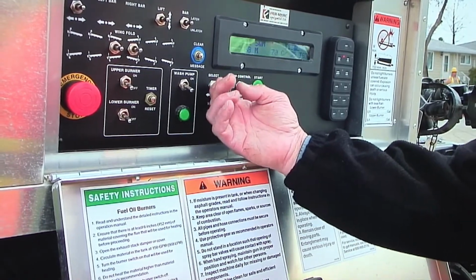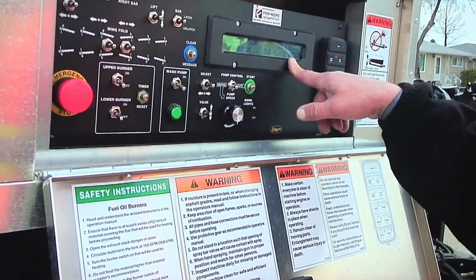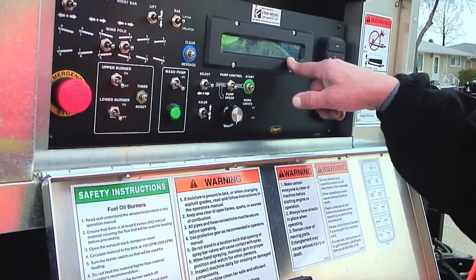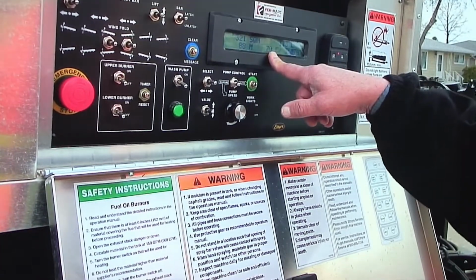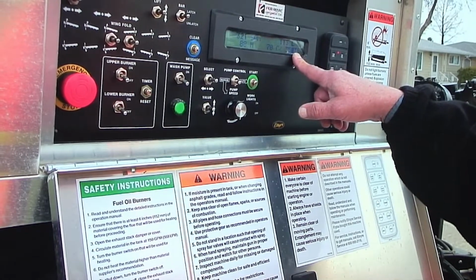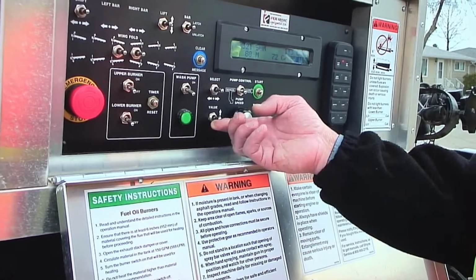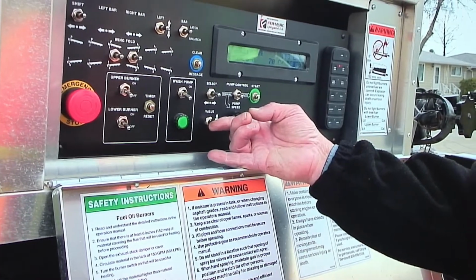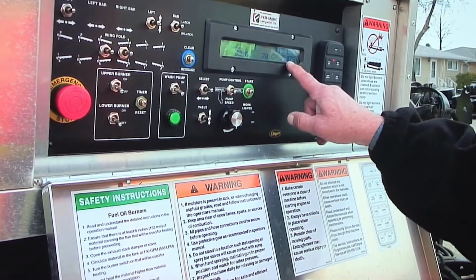3 points to the target temperature, which is defaulted at 35 degrees. At that point, we check our temperature of oil in the tank, which is higher than default, means the burners will not ignite. In order for the burners to ignite, we need to increase the value above this target, the actual temperature, in order for the burners to start.